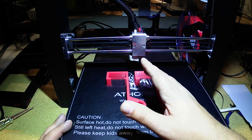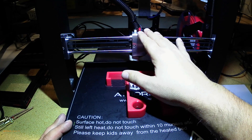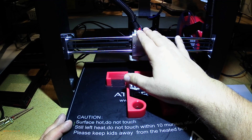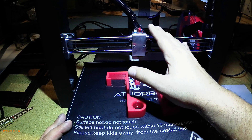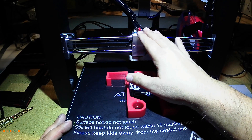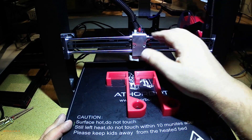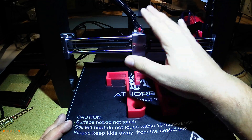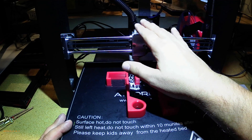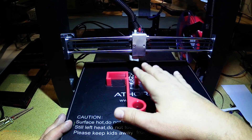The other piece I've done is switch to Capricorn tubing — you can't see it, it's inside here. This is not an all-metal hot end; I actually prefer non-all-metal hot ends with the higher temperature. I've switched all my serious machines to Capricorn tubing and I'll have links down below. I think it's definitely worth the money.